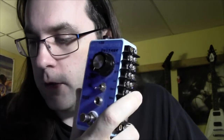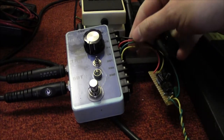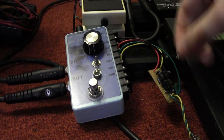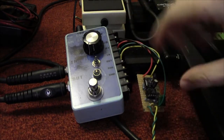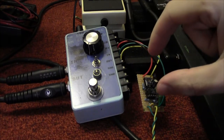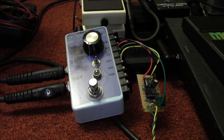So I'm going to hook up the wires to this testing rig and then hook it up to the amp and we'll test it and see if it works. As you can see we have all the proper wires hooked up to their spots — ground to that spot, 9 volts there, and the in and outs. Being a simple circuit the only thing we really have to test is this volume control. On more complicated circuits you might have more pots, switches, or whatever. The main point is: when you have this hooked up, test everything. Make sure every control works, make sure every switch works. If something doesn't work you'll be able to isolate it, and if the whole thing doesn't work you can go back and check all your soldering and make sure you have everything in the right place.